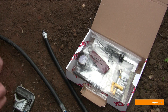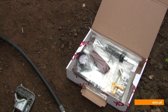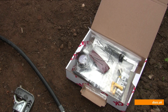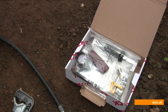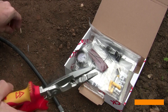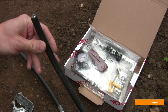That's one end fairly well prepped. The second end just needs chopping or sawing down. It's a fairly thin armoured — I'm going to see if I can get my chopper around it. I'm not supposed to cut SWA with that, but you've got to do what works. I'll just prepare this end in the same way.